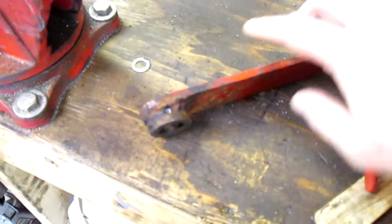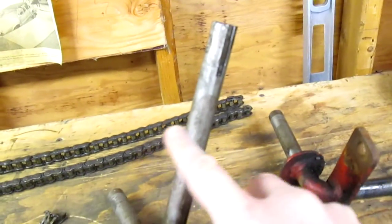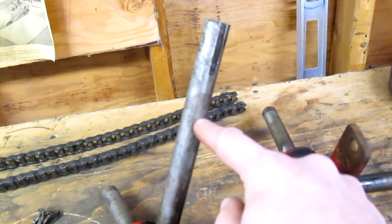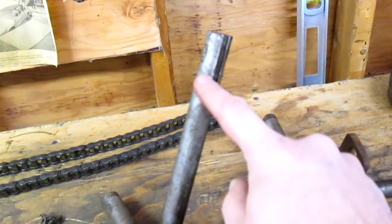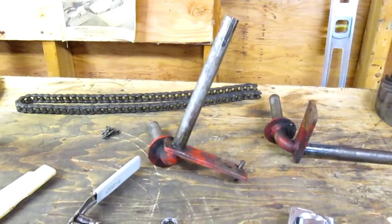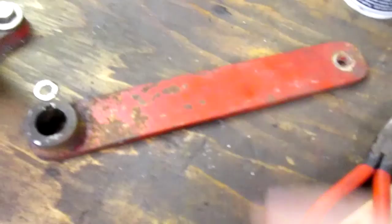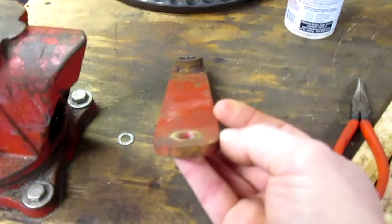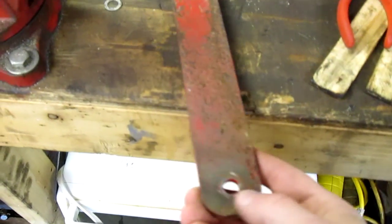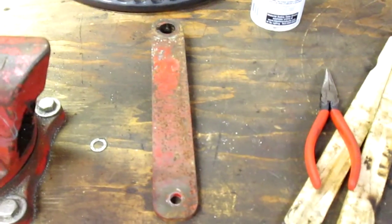On Sunday, my buddy and I are going to machine a new collar with a new keyway. I'm basically going to do what I did to one of my RJs — just cut the three-quarter inch shaft right about here, remachine a new keyway in a three-quarter inch piece of bar stock, put it together, weld it all up, and that will fix the problem. I'm hoping to have all the parts machined on Sunday and over the course of the next week I'll be able to put this all back together. I might actually make a whole new top steering arm, get a new piece of bar stock, weld in a new collar, and drill the new hole. I do not stand sloppy steering — it just takes away from the tractor.